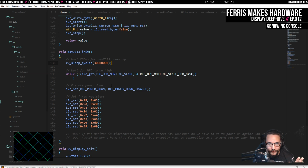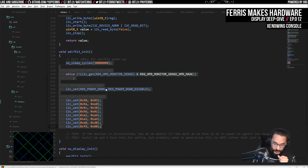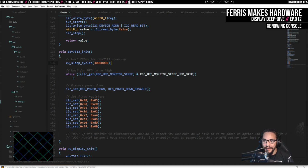The bigger problem is that whenever I run the simulator, I get a trace output, which is really valuable for debugging, and I would like to not have all of this stuff, which is going to be the same every time, represented in that trace. So I'm considering having some bit in a register somewhere where you can read it and it'll tell you if you're in the simulator or on the hardware, and that way I can just have one ROM that'll dynamically detect and then give me more or less useful data depending on which environment it's running in. We won't do that now, but that's just a thought that I had. So that's how it looks to enable the display from the software side.